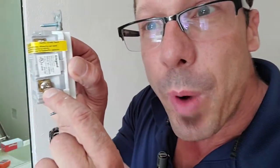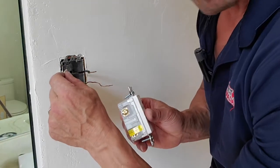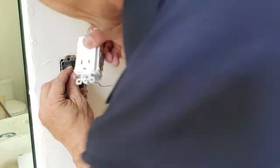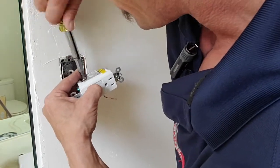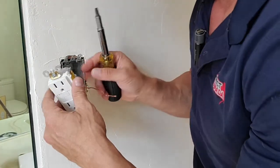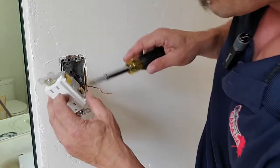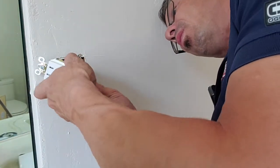On the silver screw we're going to put the white wire — the neutral. On the golden screw we're going to put the black wire — the hot or positive. And on the green screw, that's where the ground will go. I'm putting the white wire under the silver plate and tightening it up. You want it fairly tight — you don't want to damage it, but you don't want it to move. Then the black goes under the golden screw plate, and the ground goes under the green screw.